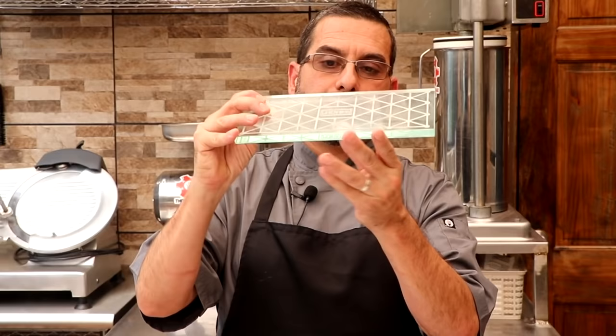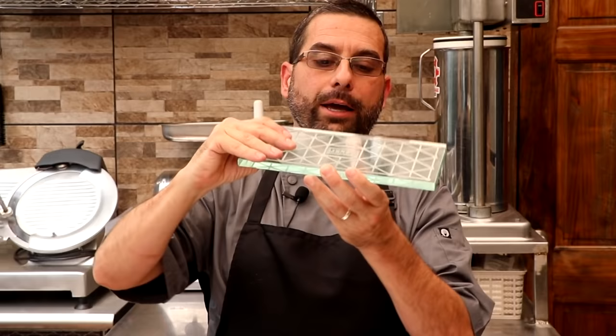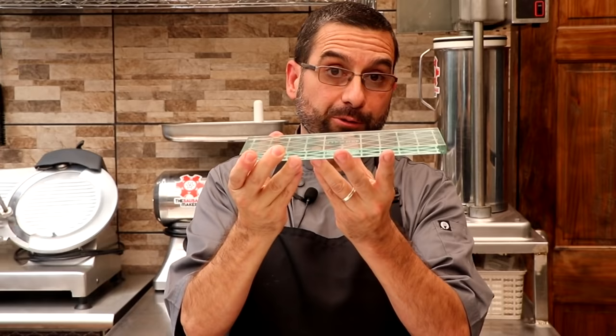In this video, we used a lapping plate from Jinda Industries. Now, under normal circumstances, this particular lapping plate is used to level our whetstones, which we use to keep our knives sharp. That's the etched side. But the opposite side is a reference plate. It's completely smooth and perfectly flat, and it guarantees a flat surface no matter where you're at.